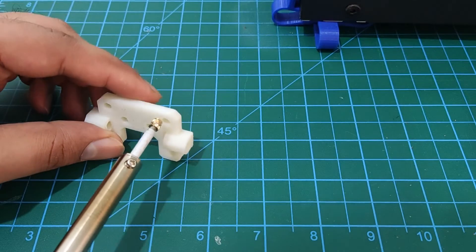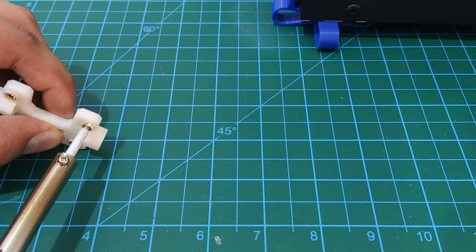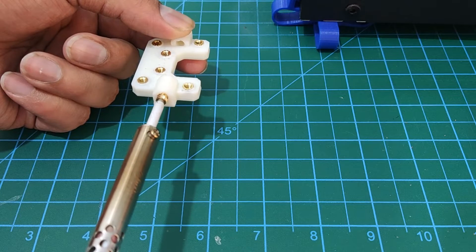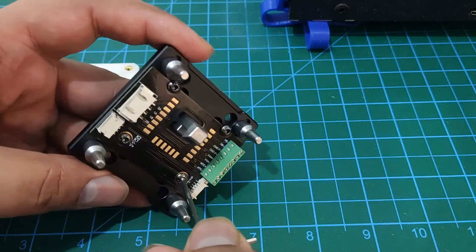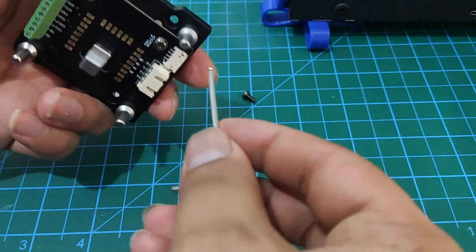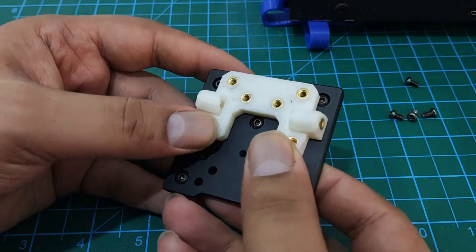As I mentioned earlier, I plan to use the same tool plates for my new printer, so I had to design this piece to hold the hotend. I printed it out of ABS and fixed the M3 threaded inserts with a soldering iron. If you are only going to use the tool plates for the Ender 3 you can directly mount the hotend. To fix the tool plate I again had to remove the PCB to access the screws. The kit comes with a variety of M3 bolts, and after lining up the ABS part I can turn over the plate to fix the bolts.